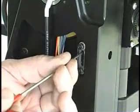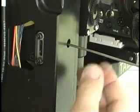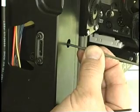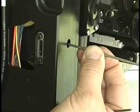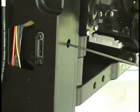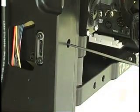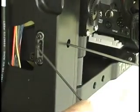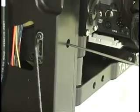These jacking screws lie on either end of an adjusting wedge, which means before you can tighten one you must loosen the other. In this greatly exaggerated example, the backlash can be seen while gently pushing the tilt plate forward and aft. The worm shaft rotation is isolated by inserting your 3/32" Allen driver into the access hole.